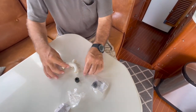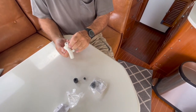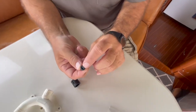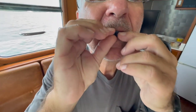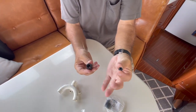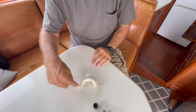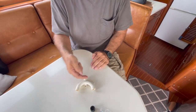I want to explain what's going on. This is a three-quarter inch vented loop — obviously the one that's there is an inch and a half — but they all share the exact same valve. There's a valve at the top, and here is the rebuild set; I have a couple of rebuild sets on the boat. You can replace the cap, and here's really the part that's failing. There's a little duckbill valve. I can blow that way but I can't suck. This open end goes into the cap, and with the vented loop, as fluid comes through, it will stop a siphon from happening because air can flow this way and break the vacuum caused by the siphoning action.